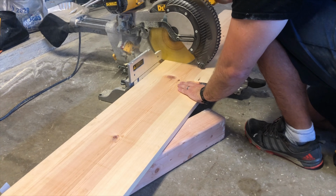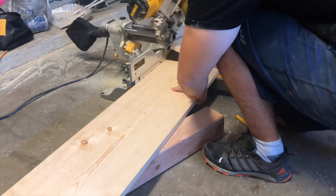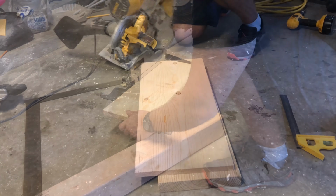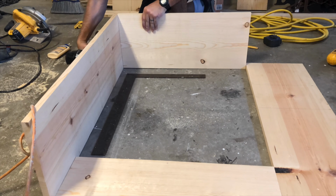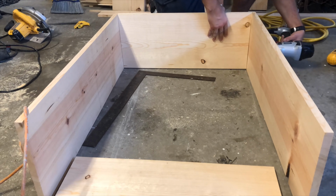I'm going to cut the 6-foot 1x12 right in half. Hopefully this gives you 2 3-foot boards. Now cut 3 that are 25 and a half inches long. I'm going to trim a half inch off the side of one of those. Next I'm nailing the 25 and a half inch board flush with the top of the 3-foot board. Make sure these are square when you put them in.